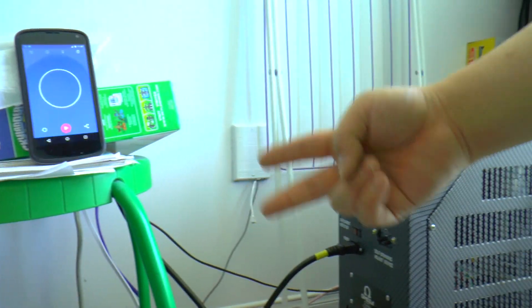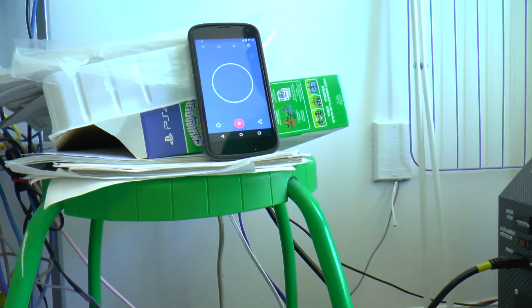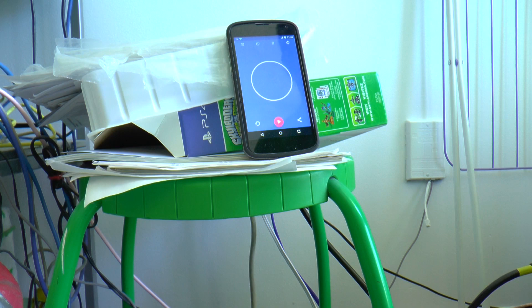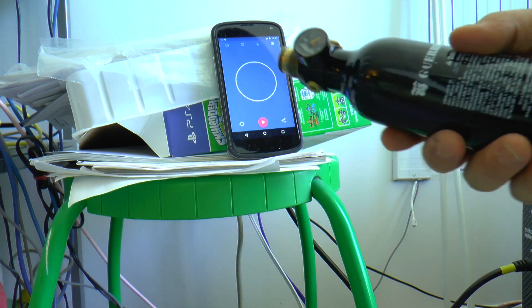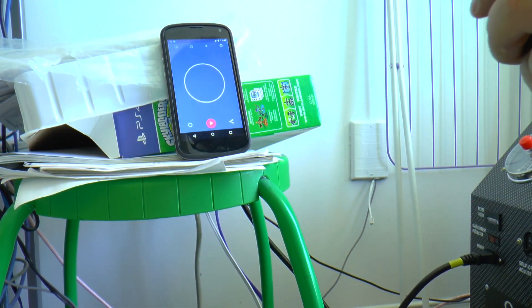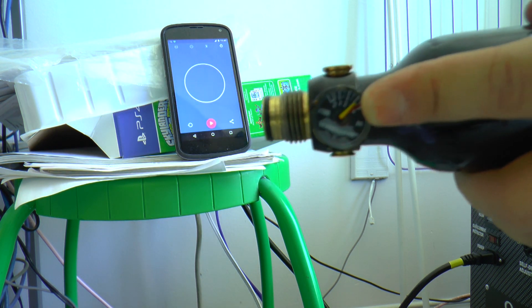The compression stopped — as you can see, the red light is on. It stopped at 8 minutes and 22 seconds. I'm going to degas the hose. The tank right now is not even warm — it's cold. The tank is now filled to a bit over 3000 PSI, which is okay.